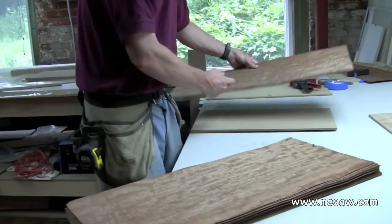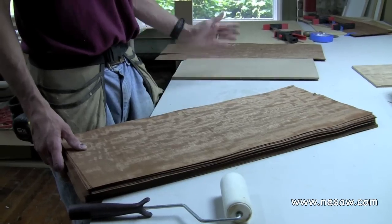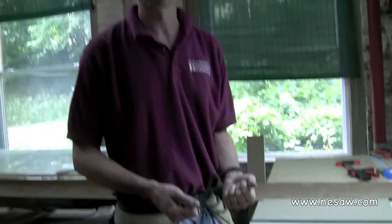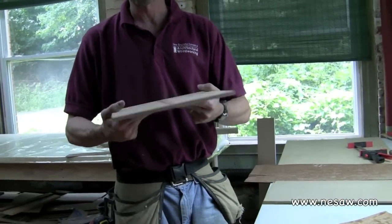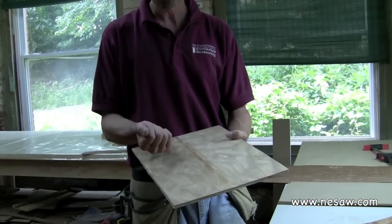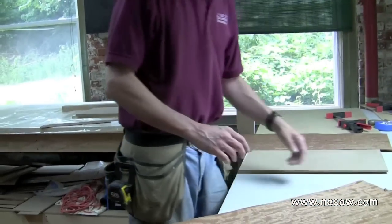On the back, since we're not going to see the back of these panels, we can put pretty much anything on there as long as we put the same thing on both panels. The reason we have to veneer both sides of a panel is because it keeps it balanced. If you only veneered one side, you would actually cause the panel to bend — that's due to the glue drying and pulling on one side of the panel. So we put something on the other side just to balance it out. You can use a cheaper veneer as long as it has similar characteristics.